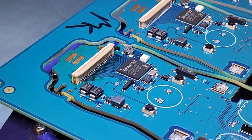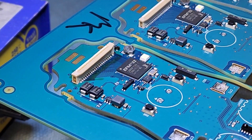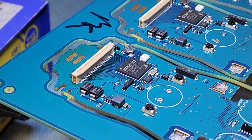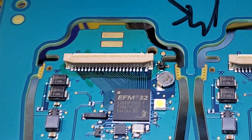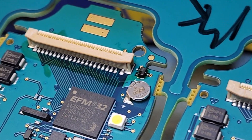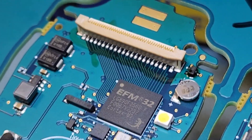It's still liquefied, so I'm going to make sure I don't bump it. Turn the board heat off. Slide it slowly out of the way and let it cool down. Yep, that's all on pad. I'll pick up the camera. I'm going to let this cool down a little bit, then we're going to clean it very thoroughly.